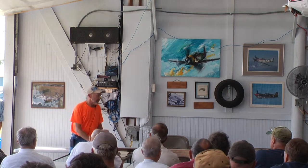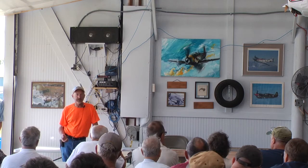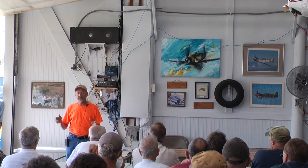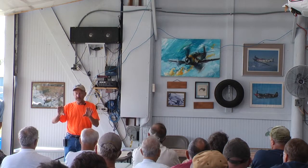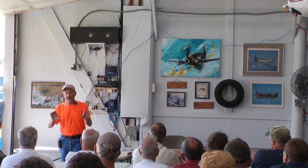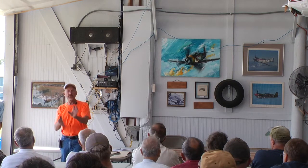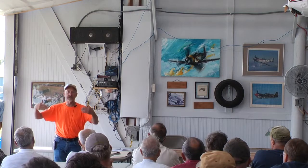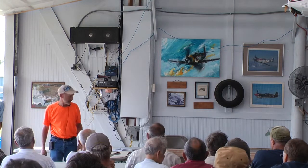Now, question, how do you, I already knew that I wanted a 46-inch pitch. And what that means is, in simple terms, let's say you had a gigantic block of jello, and you took the propeller to the face of the jello, and you started to push and advance the propeller through the jello. If the propeller has a 46-inch pitch, you rotate this propeller through the block of jello one complete revolution, and theoretically you would be 46 inches from the front of the block of jello by the time it was one complete revolution.